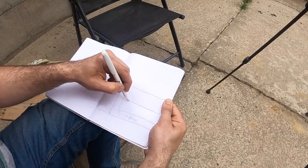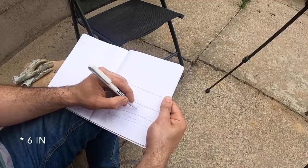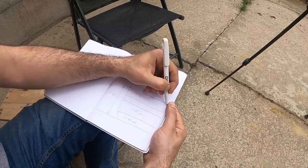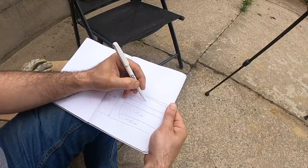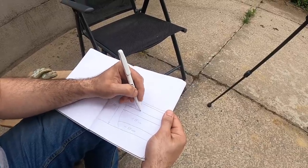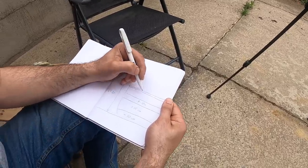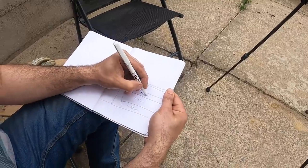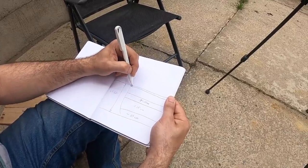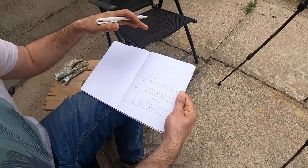Put a slab of concrete with metal reinforcing, approximately 15 centimeters, plus minus. Put insulation and then screed, maybe 7-10 centimeters. This is insulation, and depending on the insulation we need to level up to keep here like 3 centimeters for floor covering.